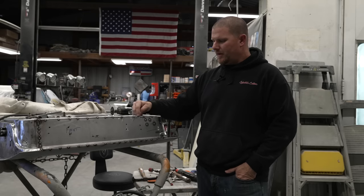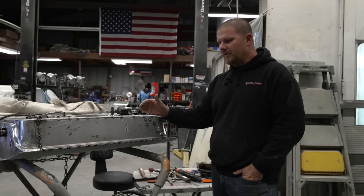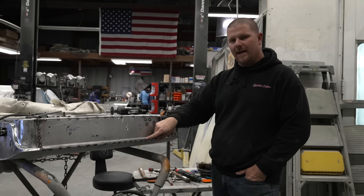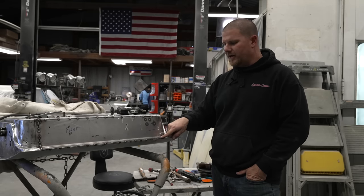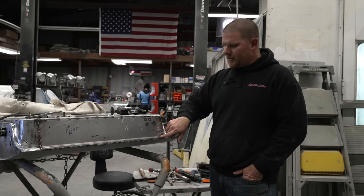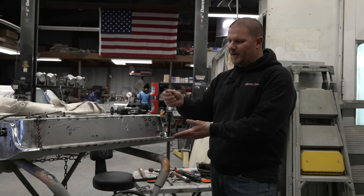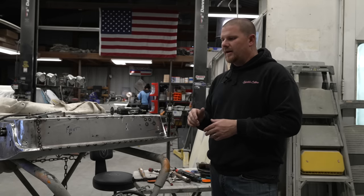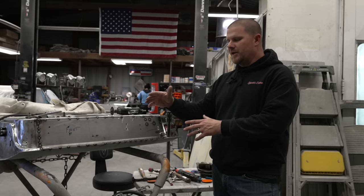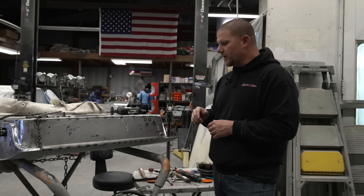You do want to put more welds in between here. And we also got the bottom lip put in. Keeping this lip cool as you go is critical because what's going to happen is I always call it turtle shelling. As soon as you start putting heat, this edge wants to curl in and you will have to hammer and dolly this edge back out. If you guys want to know more about MIG welding through this entire process, check the link in the description.